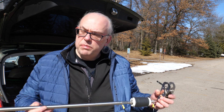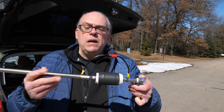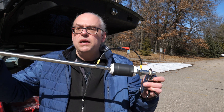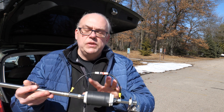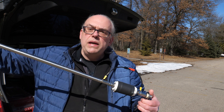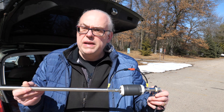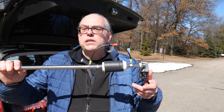One of the things about getting more joy out of a Parks on the Air activation is the expediency with which you can get your equipment set up and torn down. If you're spending less time messing around with your antennas, you can be spending more time on the air. That's one of the advantages of using this little bypass circuit. I can keep the whole assembly together to set up faster, switch to 40 meters just by undoing the little wire, or use the upper bands by engaging the bypass. Faster setup, faster teardown, definitely faster band changes — which means more time on the air. If you're a Wolf River Coil user, you might want to think about making one of these.